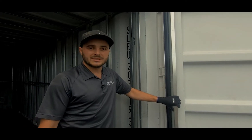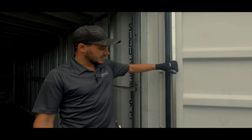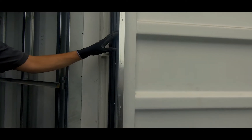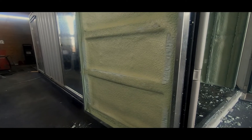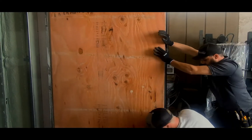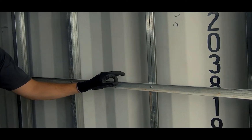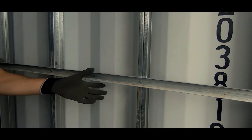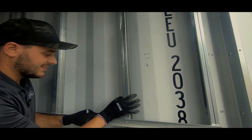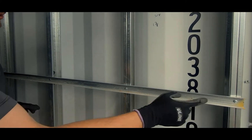We've finished up all the steel stud interior. We've used our container door flashing kit — this installs on the doors rather than having to stud the door, and it retains all the spray foam and allows us to plywood and drywall line the interior. One huge tip: when you spray foam the container, you need to put a furring bar either inside the studs through the holes meant for it, or with 2.5-inch steel studs you can surface mount the furring bar to the studs. When they spray foam, the studs don't twist as bad and they stay nice and plumb for your sheeting afterwards.